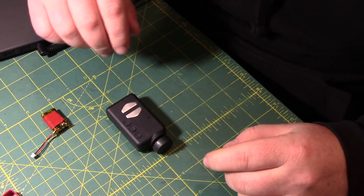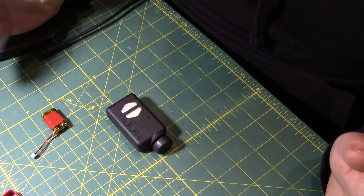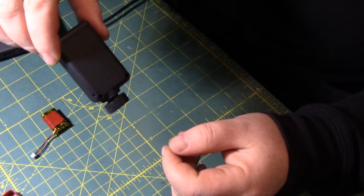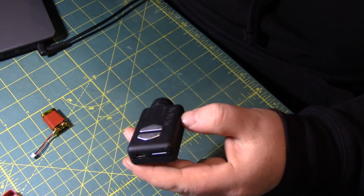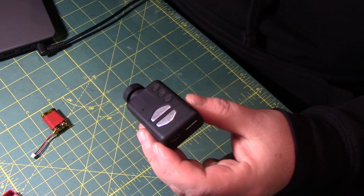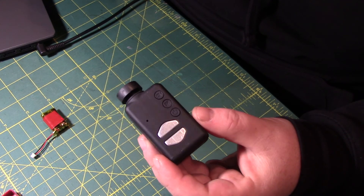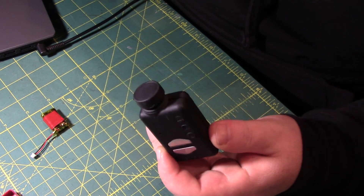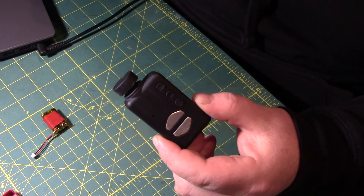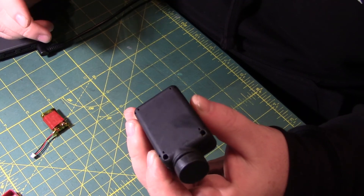It's on my Mini, so it's lasting 5 minutes and then midway through. I'm only getting maybe about 7 minutes of run time on a fully charged battery. The reason that it died is on my Skywalker and my Twin Dream, I've been powering the Mobius with a constant 5 volts, just because on those two models I'm always flying more than a half hour. And the battery life, even with a good battery, you're pushing it — I've flown for 45 to 50 minutes, pretty close to an hour, depending on how I'm on the throttle. So the stock battery would not last even when it was new.